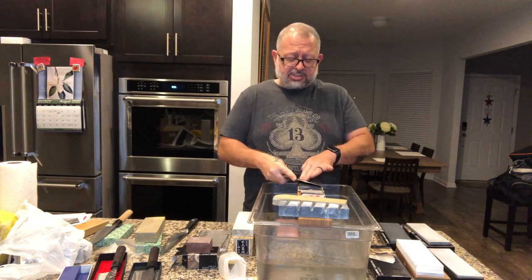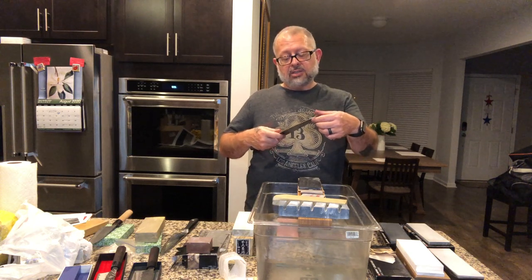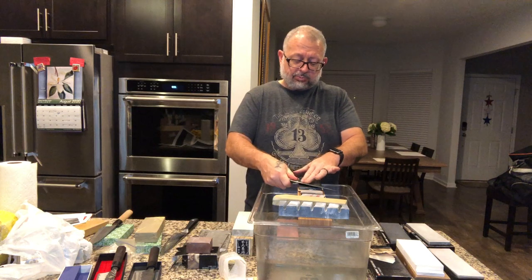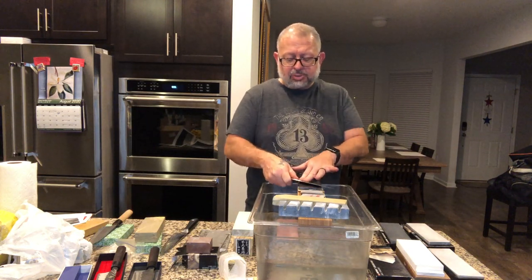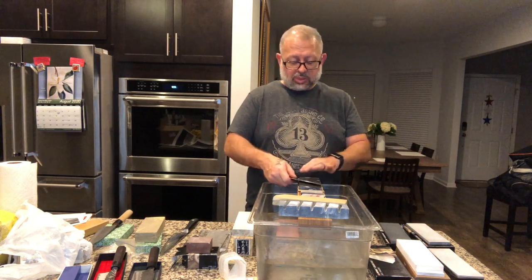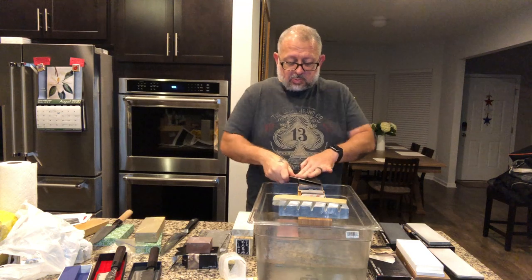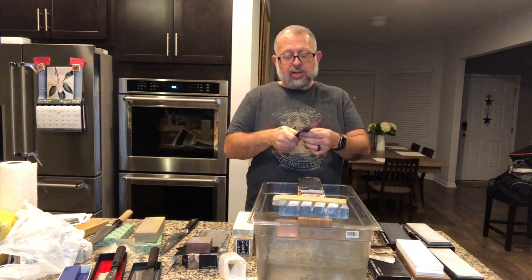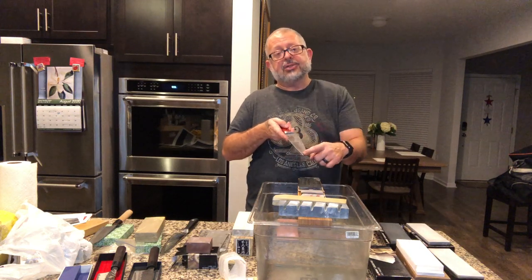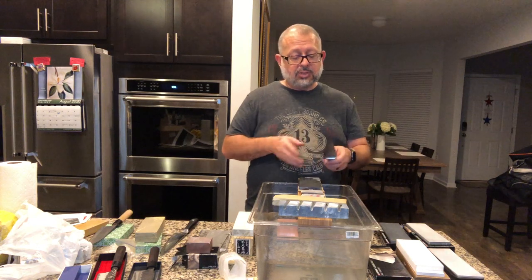My pressure's pretty light. Honestly, if I wanted to really get a burr on this, I could have just jumped down to 400 or whatever. Oh, we're there. Oh, perfect. Okay, so we don't have as much of a burr here. So we're going to focus on the back side. I mean, on the down part. So I'm pushing, riding back, pushing, riding back, pushing. Too much metal and I will change the profile of the knife. There, it is nice.